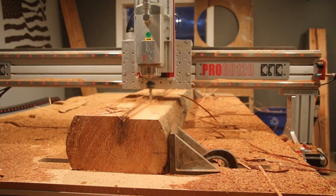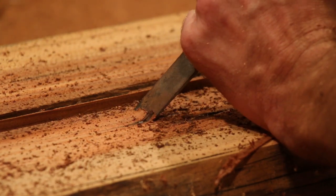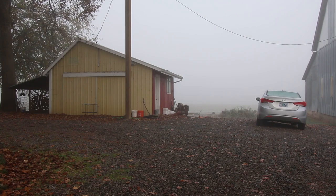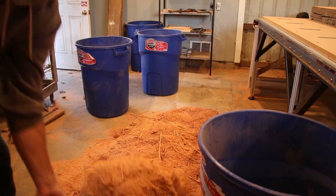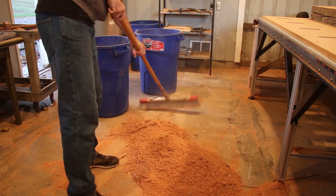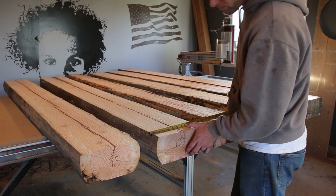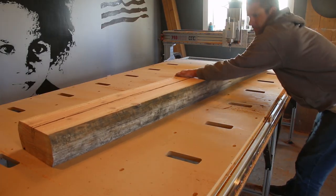The CNC table gave a nice chirp every time it found a nail — luckily there were only a couple. For a week or two there was just a lot of milling going on, sun up to sun down. I started hearing the router bit noise in my sleep. It was really cranking out the sawdust; every couple of logs I would stop and sweep, and I started piling up sawdust outside on the farm. I eventually got all the logs I needed for the tabletop milled down to five inches. For each log I decided how wide it should be, trying to get everything out of them I could but still cutting off any rot on the outside.